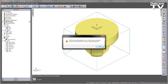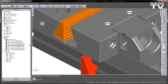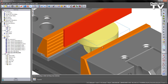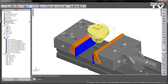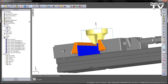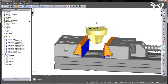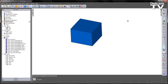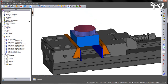This is a read-only file, so it's asking me to save — I'm just going to let it import the vice. You can see it imports, adjusts the positions, goes through the parallel import, and then shifts the stock location. I've now imported the vice and we can see the position and location of the part is mounted nicely. If I play my 3D simulation, the vice is automatically loaded as a clamp inside the simulation.